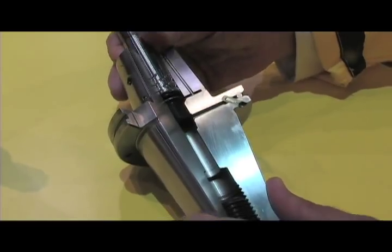It's a secondary locking system for security. The motivation is that when targeting titanium milling operations in airframe, the tendency is for the tools to pull out. We use higher helix tools, there's a lot of axial force on the tool, they tend to pull out, and that could be catastrophic in airframe manufacturing.